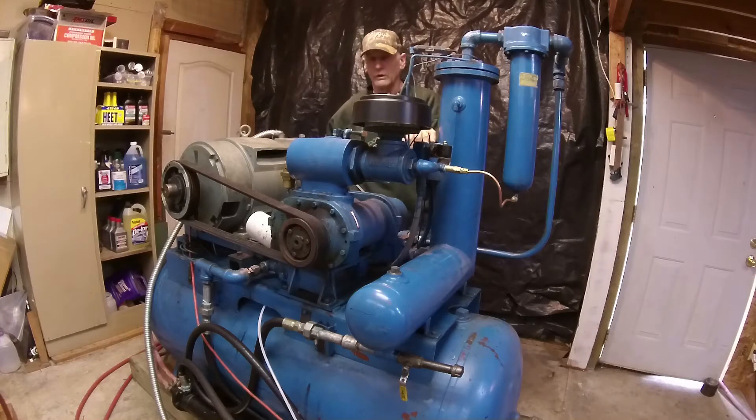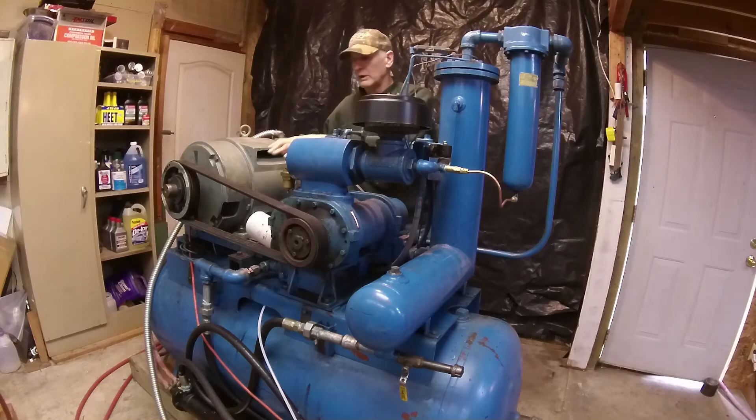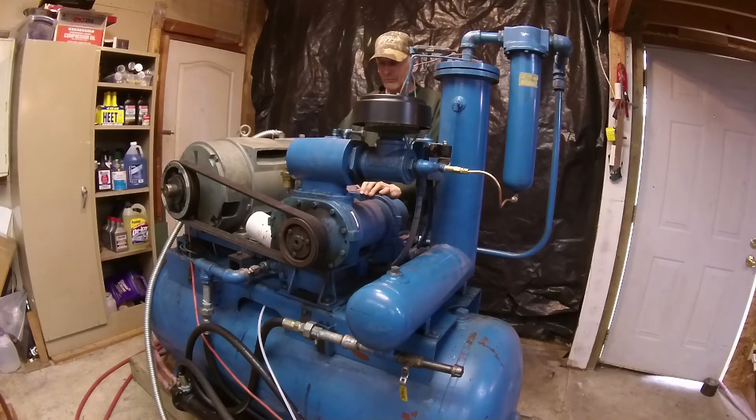These rotary screw compressors are entirely different. They started in the 1960s or so, and first produced lower pressure. This one is rated to go to 185, but the pulleys are designed to overdrive it to get around 100-120 pounds. In order to regulate that — because you're not building up to 175 and drawing off of that, you're just using and generating a hundred pounds — there's a regulator valve on top that blocks off the intake. On the side is a real pressure regulator, and when it gets to about 97-98 pounds, it starts closing a valve and cutting off the intake, running with the intake blocked off.